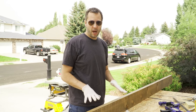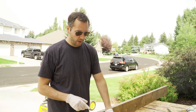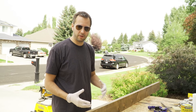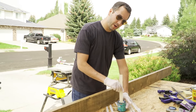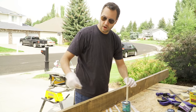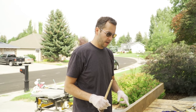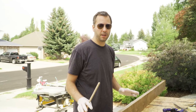This is looking really nice, but the final step is to keep it looking nice for a long time by adding a coat of polycrylic. We're going with the clear matte finish, which won't affect the current finish or make it shiny — it'll just maintain its rich, rustic look. Stir it and keep it stirred as you work. Apply in long strokes across the entire thing. The recommendation is three coats with two hours of drying time between each coat — still quick enough to get it all done in one day.